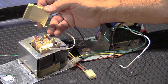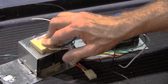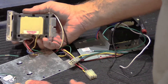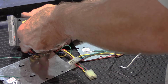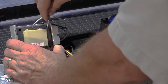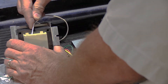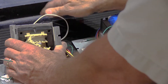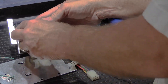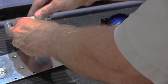The Newtone transformer also has fused outputs, however the fuses are buried down inside under blue tape and whatever else is underneath, and it's not done in such a convenient way to access the fuse. The Music and Sound design — which I prefer — allows a repair shop to easily remove the cover, desolder the fuse, replace it, and put the cover back. We certainly would not bypass a blown fuse, since it's ETL-rated to have one in place. Removing the second cover on the Music and Sound transformer, we find an identical fuse arrangement on that side as well.